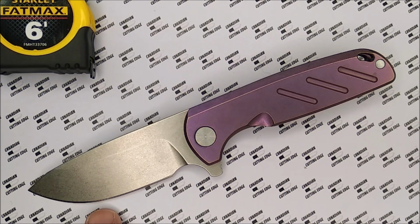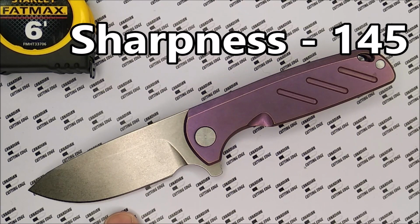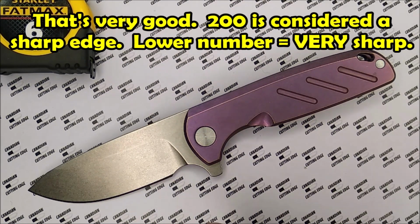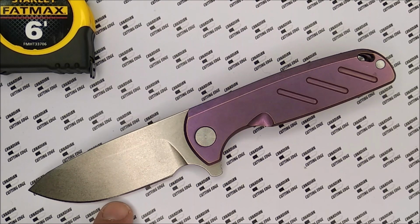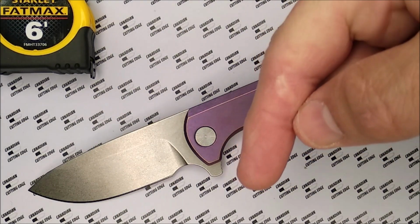The sharpness of this edge was better than I thought. It tested in at 145. That's grams of pressure to cut a piece of monofilament fiber. And I cut 3 times and averaged it out, and all the cuts were pretty close to the same number. Good and sharp. If you're not familiar with my sharpness testing, there's a link down below in the description area.